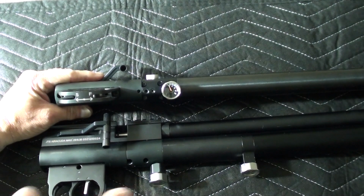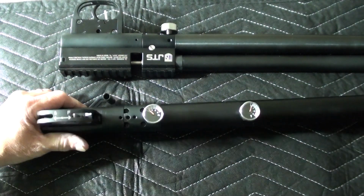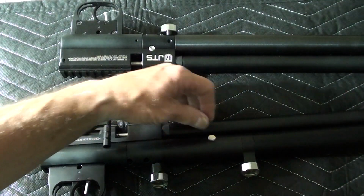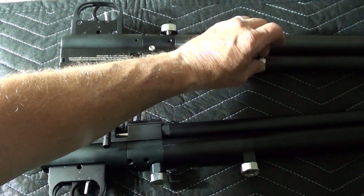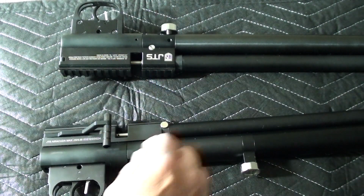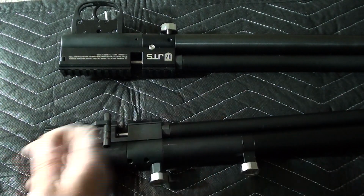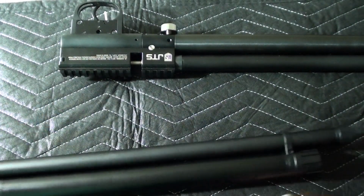While we're at it, these guns are degassed. I'm going to be changing seals on these. The easy way to remove a tube on the Max, well, we'll go to that in a moment. Also, Airacuda Standard uses a steel tube, and the Airacuda Max uses an aluminum tube that is not ferrous. The magazine tubes on the two guns, I think, are aluminum, but I think the magazine is being attracted to the steel barrel underneath. The part where the barrel threads into the retainer that goes into the stock is steel.